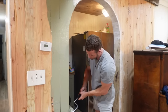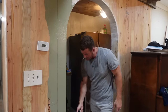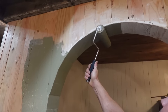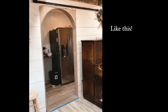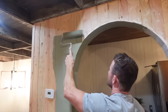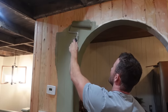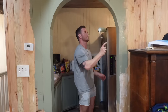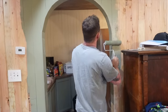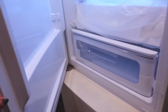One thing I really wanted for this room was an arched entrance. We got rid of the barn door, and Thomas widened the entrance about eight inches, which made a huge difference. He first framed in two corners to create the arch. We ripped all of our old shiplap off the walls, then ripped the pieces in half so they were eight inches, installed horizontally — we then cut them to four inches and installed them vertically, which flows better with the rest of the upstairs.